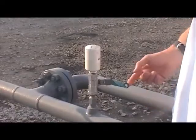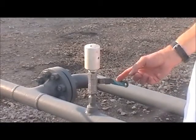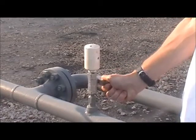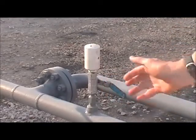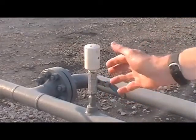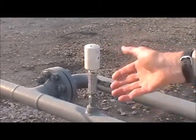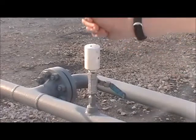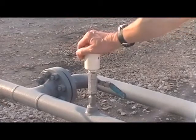Start the sampling, crack the valve, and allow gas to flow for a minute or two to flush the bulb and fill it with dry natural gas. To get a good sample, all you need is a flow of about one liter per minute. Without a flow meter, a good rule of thumb is to put your hand over the bulb — you should be able to feel the flow without necessarily having a strong force of gas flowing.